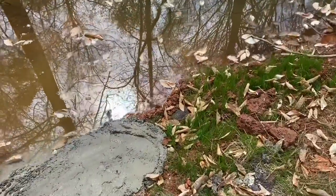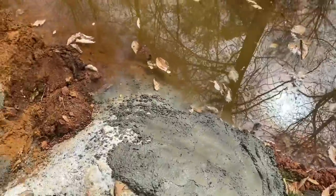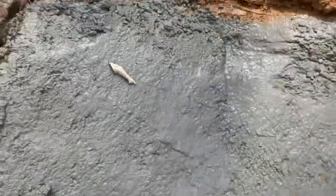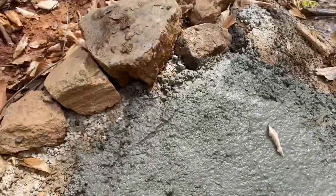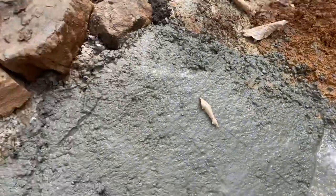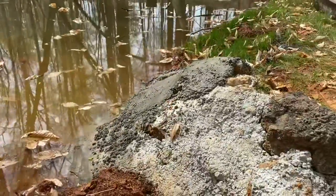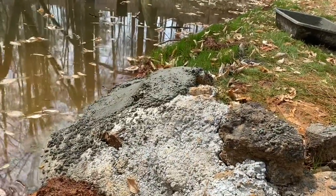I had an extra bag of concrete so I just kind of made the face of the spillway a little bit bigger and I built me a little cofferdam right there. This spot on the spillway was kind of poured thin, so I put another inch on top of it. I mean it's been holding up good — we've had some big rains — but I got that face right there just a little bit better, that'll help with erosion.